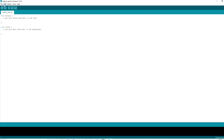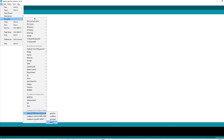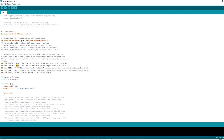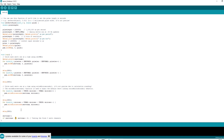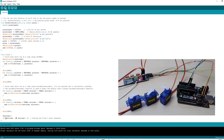In the final step we're going to use an example sketch that comes with one of the libraries to test that everything's connected up and working. Now's the time to plug in your power supply and make sure your Arduino is still connected to the computer. In the Arduino software go to File > Examples, scroll down to the Adafruit PWM Servo Driver Library, and click on the servo example. Change SERVO_MAX from 600 to 450 and US_MAX from 2400 to 1800. Scroll down and change the number of servos from 7 to 2, since we have servos on positions 0, 1, and 2. Click Upload — it'll verify the sketch and upload it to your board. If everything is connected correctly you should see your servos start to move, looping through each one and moving the arm from side to side.